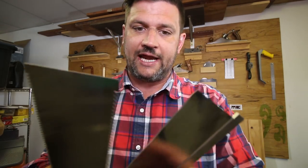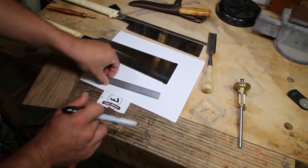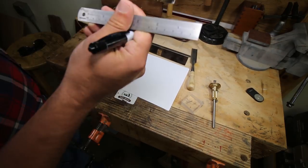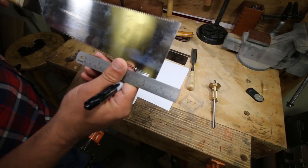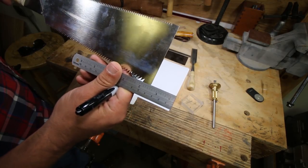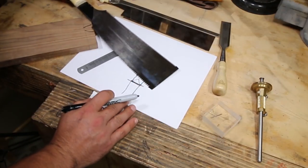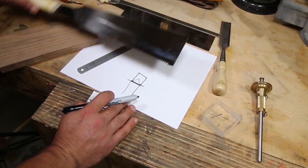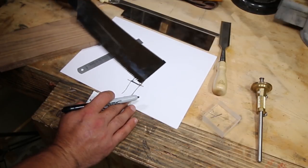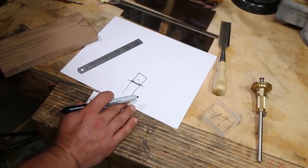I'm going to show you a little trick for clearing out waste in between the two sides of your board when that happens. The teeth on the Japanese saw are straight, and then when you look at the end, you can see that this last little part is even with the last tooth — and that is a depth stop. Let's say this is your board and this is your depth stop line. You'll cut here and then you'll cut here. So what you can do is take this and use it as a depth stop and get that last little bit so you're perfectly down to your line.